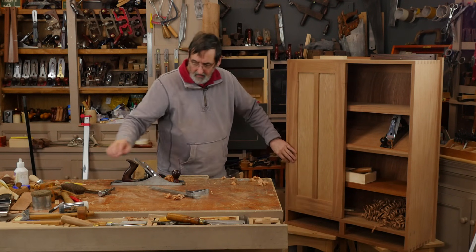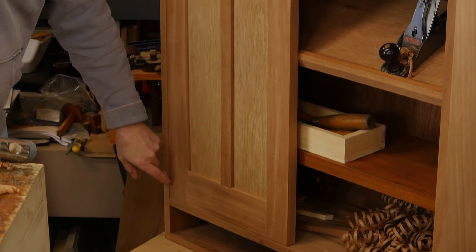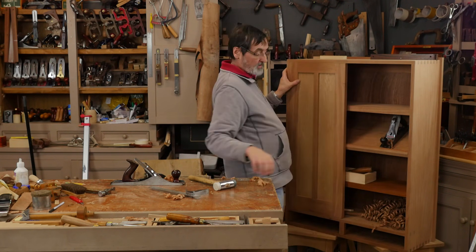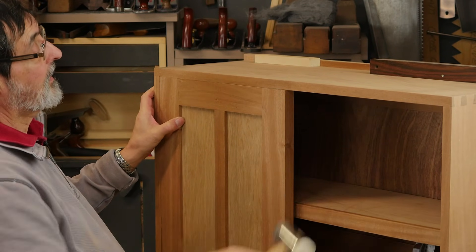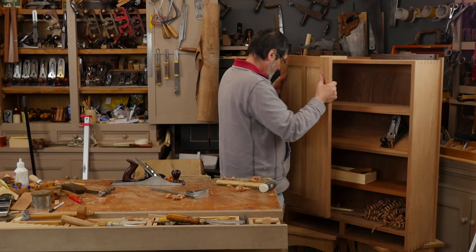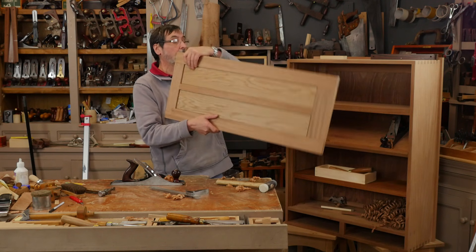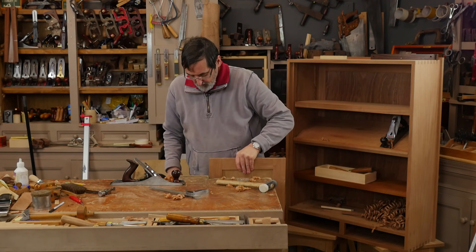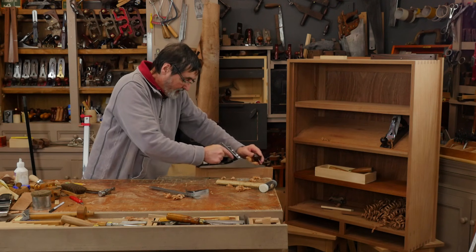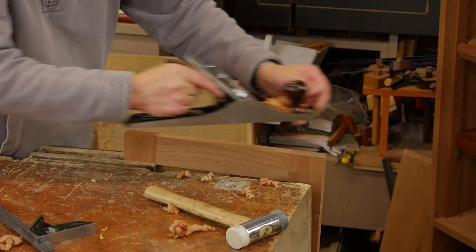You've got to watch the door when it's freestanding. I've already checked by winding this stile in to the stile over here, so I've made sure it was not twisted. You have to make sure your cabinet is not twisted because if your cabinet is twisted, it'll show when you're fitting the doors. Keep it nice and firm. This is just a trial and error — a little bit less error than trial, I hope. I'm close; I like this nice tight fit. A good sharp plane is essential — the first thing you want to do before fitting the door is sharpen your plane.